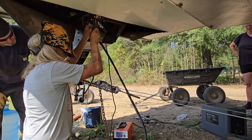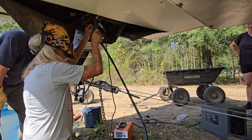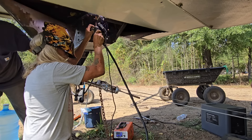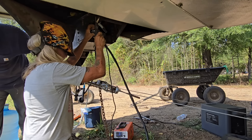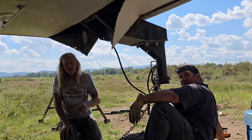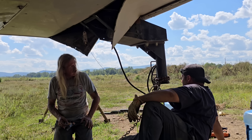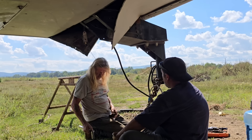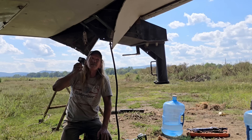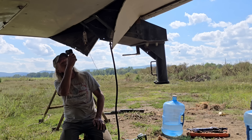For those of you that don't know, sometimes you gotta make sure you have a clean ground — otherwise this thing can shock you, blow up batteries, all kinds of good stuff. So make sure your ground is good and clean when you're trying to weld. Being we've got a ton of powder coat to cut through, we're gonna turn this dog way up and see if we can't make something happen. I need a new welding helmet — that's what I need. Wiley will need us to take that gooseneck off. It looks like it's just four bolts — we get to try our new tool finally. It ain't the prettiest welding in the world because there's a lot of powder coat on there. But it seems to be holding — we took the come-alongs off and it didn't move, didn't pop, didn't crack. I think it's going to hold long enough to get it in place, and that's all we're worried about.